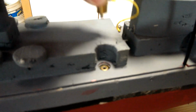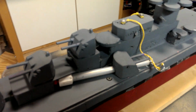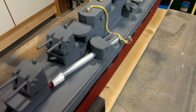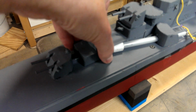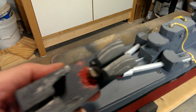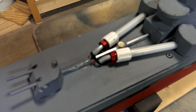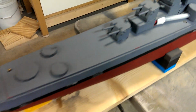This little guy here is a power cutoff. And here's a starboard baby cannon. This is angled forward and 15 degrees off the center line, as allowed by the IRC rule set. This section here is magnetically held on and pops off so I can access the cannons where I can adjust the power, or the tweak of the cannon, as we call it. It just snaps back in.